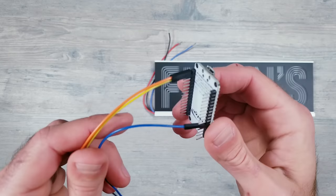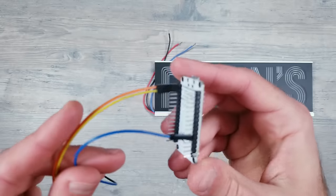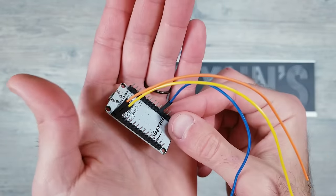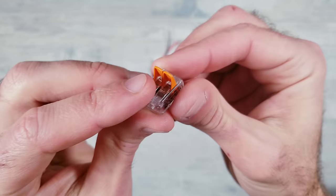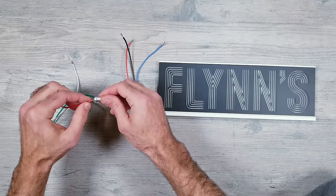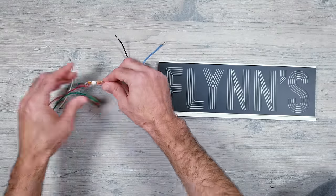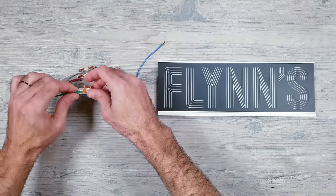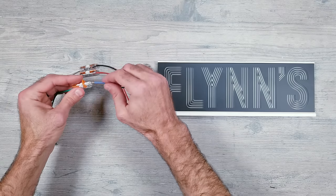You may have noticed I soldered my own wires to the board, which I cover in my soldering video. You can use breadboard jumper wires, but these wires are tiny and the cables don't stay on the pins very well, so I much prefer using my own. Next I'll be using WAGO connectors to attach the wires together — either style will work for this scenario. My red voltage wires go together, my white and black ground get connected, and finally my data which is the green and blue cables.